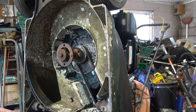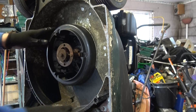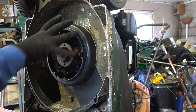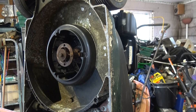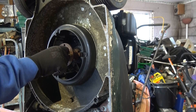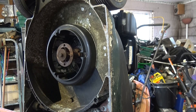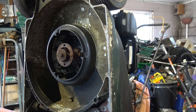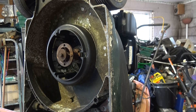Now it's just a case of installing the blade boss and the shield here — five 8mm head bolts and a 14mm for the blade. What I've got to do is put some copper slip on there before I put the bolts in so they won't get seized in for next time. I won't show you that because it's a simple enough process.